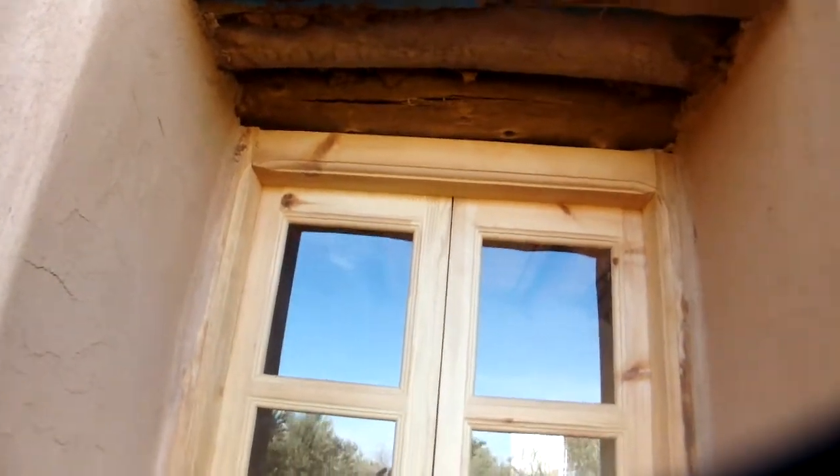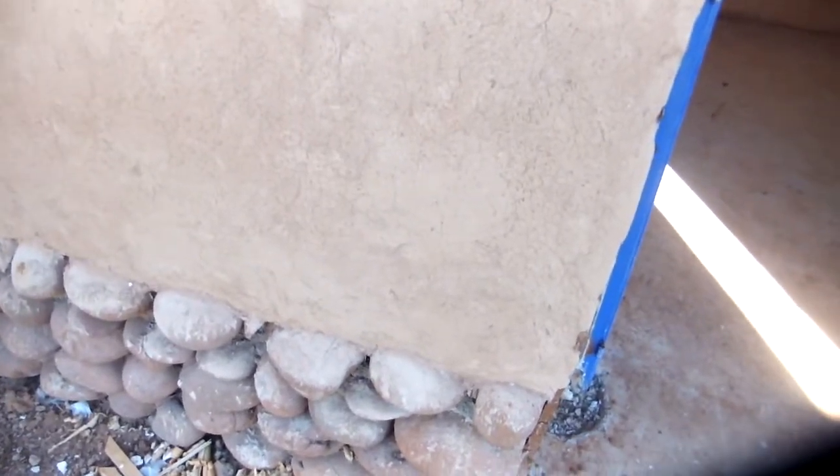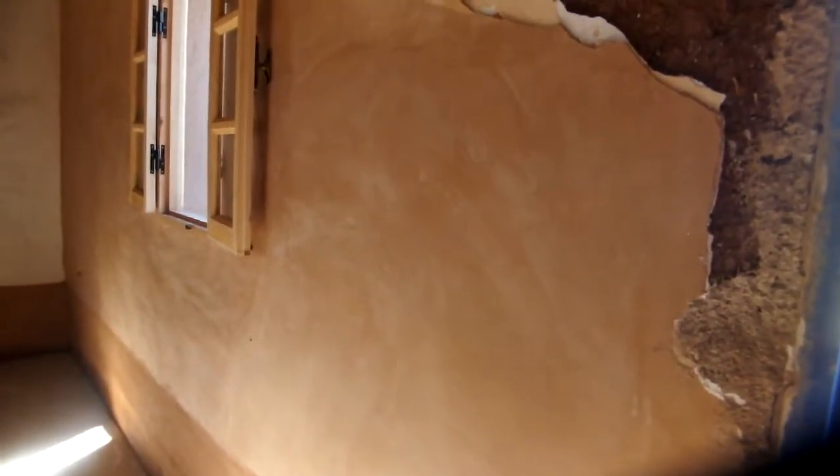Something worth knowing from standard brickwork practice: the bricks are laid in a staggered fashion — not with one brick perfectly aligned on top of another — though you can't see this since all surfaces have been plastered. Also important in plaster mixtures is getting the moisture level right. If there's too much moisture, the plaster buckles and cracks. This structure was completed in September and shortly thereafter some damage occurred because the mixture wasn't mixed properly, affecting how it dried.